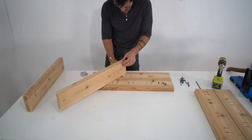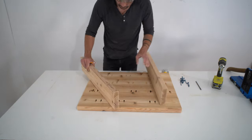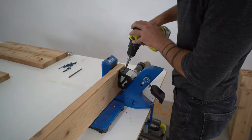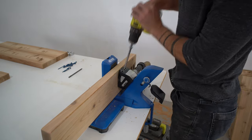This design is pretty flexible — if you want a more loungy sofa, you can just take a lower angle on the back supports. I'm going somewhere in between upright and loungy, and I drilled in four pocket holes to attach these back support pieces to the support panels going underneath the sofa.